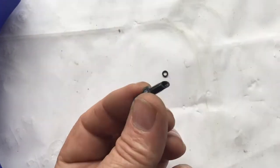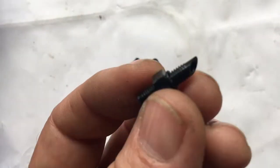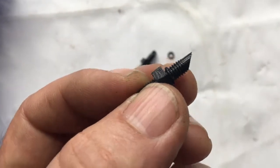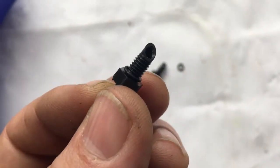What I do when I screw this in from the inside is put a little o-ring — this little o-ring goes around the shaft, so when I screw it down on the opposite side I've also got an extra safety on the seal by this little o-ring being squashed.